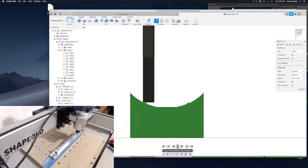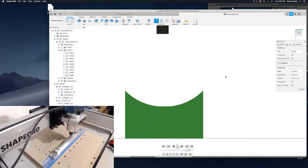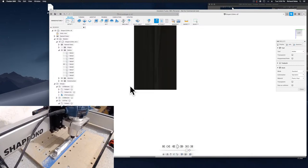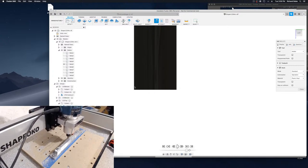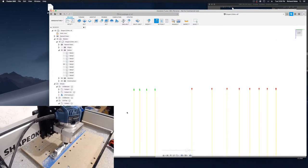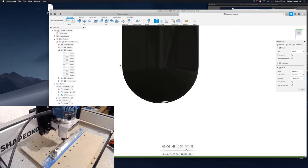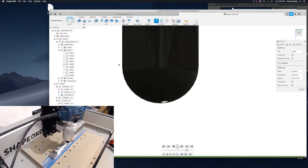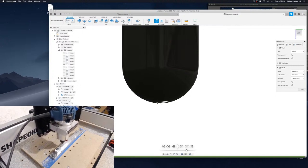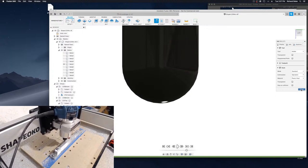And I wanted to remove as much material as possible with the flat end mills, because the ball nose end mills, they're not really good for removing a lot of material. When we talk about setting speeds and feeds, that's all dependent on knowing at what speed this outside edge of the cutter is moving when it's spinning. On a ball nose end mill, that is not constant because the radius is different. The speed that the cutter is moving up here is like 15,000 RPM, whatever you've set it to, but the speed at this very tip is essentially nothing. So you want to remove as much stock as possible with the flat end mills.